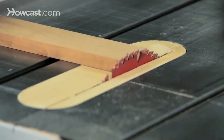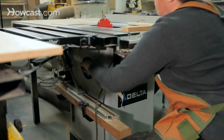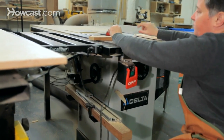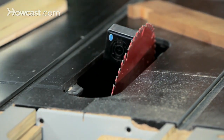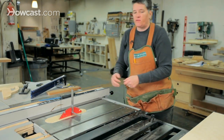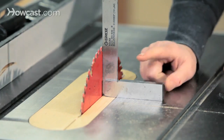The other control is on the left side of the saw — that allows the blade to tilt. I'll take this throat plate off and raise the blade so you can see this more clearly. If you turn this hand wheel, the blade will start to tilt over to the left, all the way to 45 degrees. You can do angled cuts and just use a block to measure the angle, or if you have a digital gauge it snaps right on the saw and shows you the angle as you tilt. Because the blade can tilt, always check that the blade is actually at 90 degrees when you come to the saw. Use an engineer's square — push it against the blade and check if you see any light. If not, you're good to go.